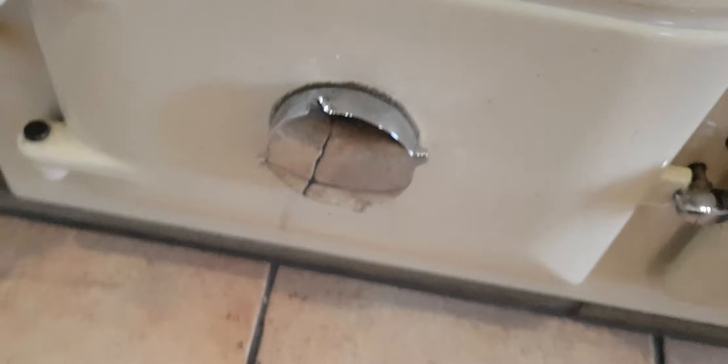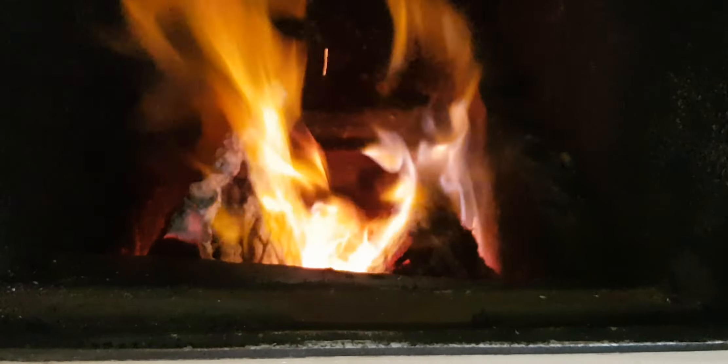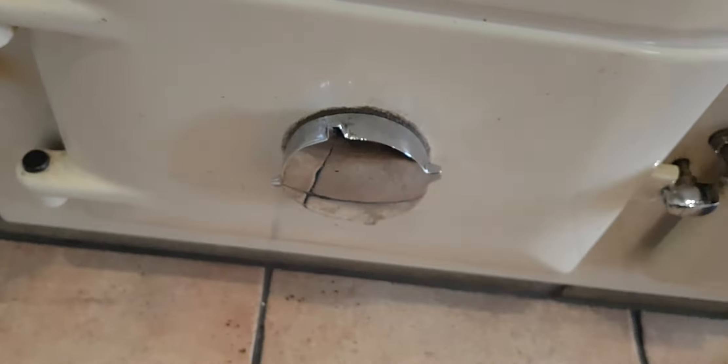Let's just talk about what it does - that air. There it is going over the back. Look at the flames - it's diverted, it's gone to a different place. So ticking over, somewhere in the middle, balance down. Once it's hot, get it ticking over. You don't want to burn the wood away, you don't want to incinerate it - all you want to do is tick over. Sort your air out. If you've got wood, slide it to the right. Balance your air. Happy Rayburn.